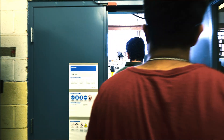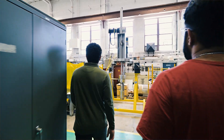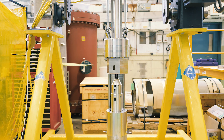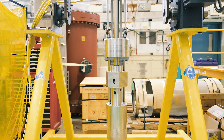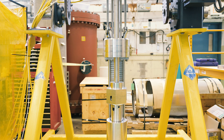The test article that we're presenting here today is the gripper test assembly. The gripper test assembly is the gripper head — the component of the fuel handling machine that will go down towards the core, attach on the top of a core component or the fuel assembly, and then pick it out of the core to either move it to another location, to send it out of the core for storage or reprocessing, and then install a new core component or fuel assembly. So it is the head that attaches to the top of the fuel assembly.